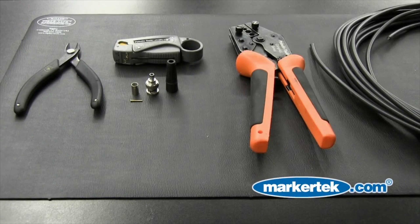Today we're demonstrating the proper technique on how to build an HD RG59 BNC coax cable, terminating Belden 1505A RG59 75 ohm SDI coaxial cable with the Kings 2065-2-9 BNC crimp connector. This precision video cable for analog and digital HDTV SDI signals is ideal for broadcast applications and meets the industry's stringent HDTV standards.